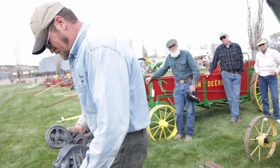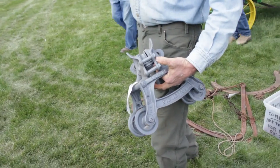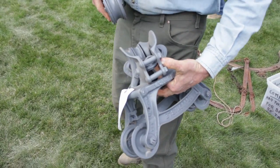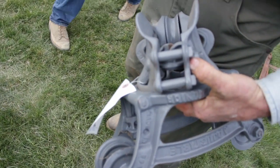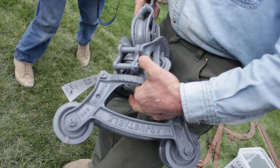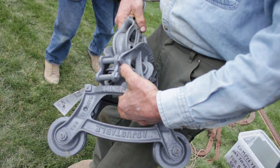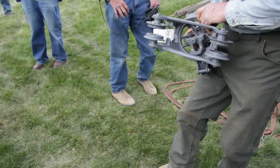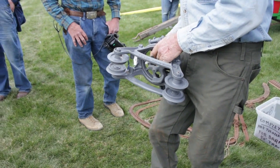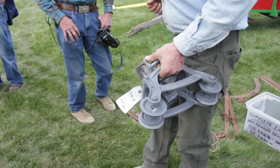And the way that lock worked is it's right here. When this pulley's going up, and it bottoms out here, see how it's going to bottom out right there? It's pulling in, and then it hits this mechanism, and then it grabs that pulley. See, that locks it in there. And then it pushes up and releases the lock on the track, and then it takes off and goes into the barn.